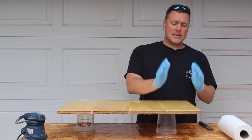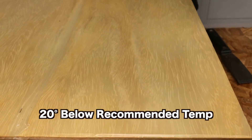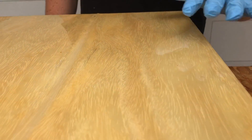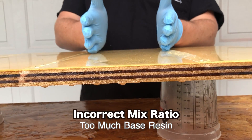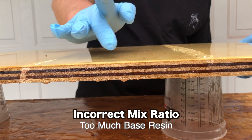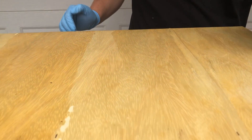Here on the end is the section we poured in 55-degree temperature — it's mostly cured pretty well, nothing really to complain about. Next up is the section we poured two-to-one base resin, so two parts base resin to one part curing agent. As you can see, it's a little wavy in the front and in the back — it just didn't cure a hundred percent correctly.